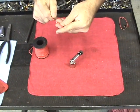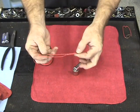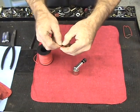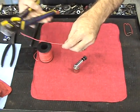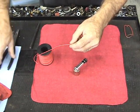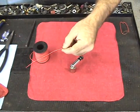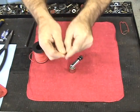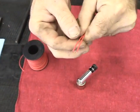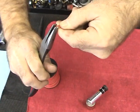Alright, so you should have a piece of wire about yea long, about like such. Now what you're going to want to do is the top piece right here — you want some of that insulation taken off. So I've already got it marked with a bend. I'm going to go in there and open it up with my handy dandy strippers — not the kind that you pay for in Vegas. So open it up, you're going to bend it over like such, and you're going to crimp the end like such.